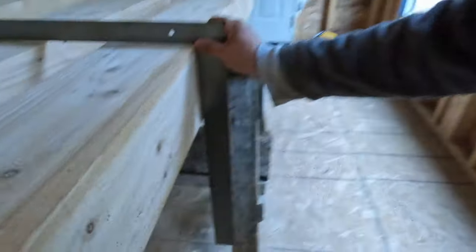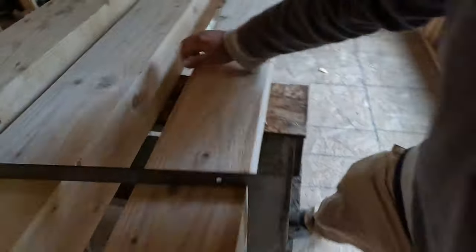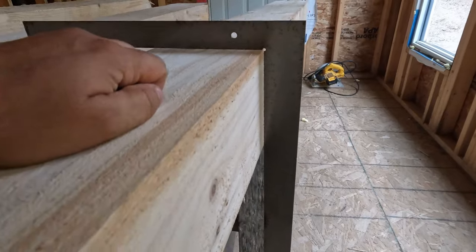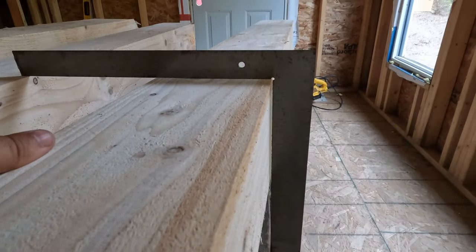But like I said, that one over there is lifted up. If you look at that, it's beautiful, nice and square. Not seeing the light shine through on the bottom or the top. When you do a little bit of timber framing, what you want to do is find the squarest side. But I've gone through these and it's really square all the way around, so I can pretty much just draw which side I want to make my marks from.